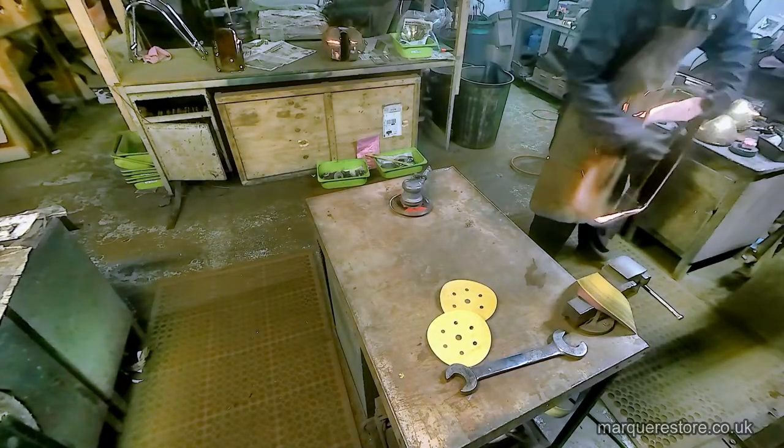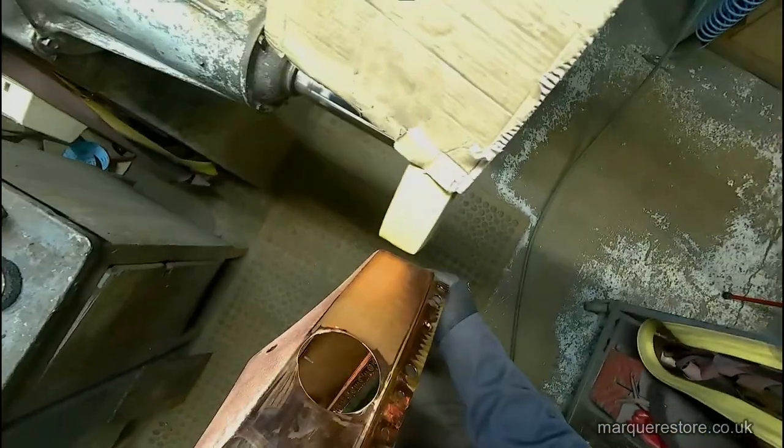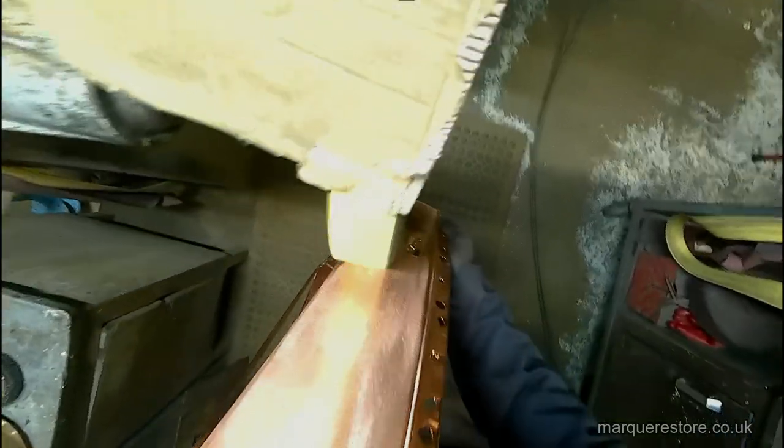Now he's gently going to use an abrasive belt, because that's a quicker way to cut it out. Now the reason he's gone with a DA sander at the bottom is because where these leaded areas are, you really don't want to put any heat into it, because if you start getting it hot, then you're going to actually start to bubble the lead up, and then it will all blister and it will be a nightmare, and you've got to cut it back to the brass and start again. Notice how with the initial polishing, he's still avoiding those edges, which we'll neaten up later.